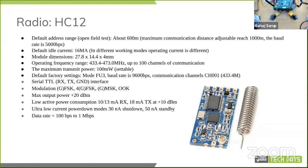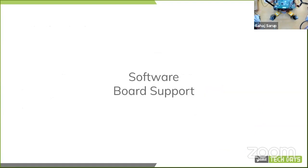I have my controller, this is my test controller right now, which is based on an Arduino. And it works as if the Arduino board is directly connected to my STM32 board over a physical UART line. That way, there's very little configuration to be done, although this can be configured over AT commands, so you can set your baud rate and stuff like that.